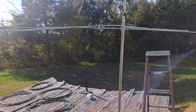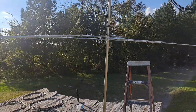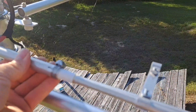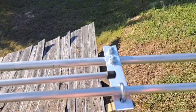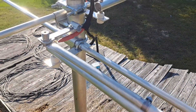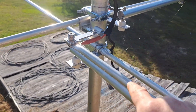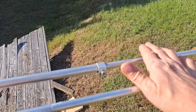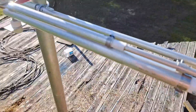To drive a Mako Shooting Star, usually it comes with some relatively small gamma matches. Let me give you an idea of what I'm talking about. These are the little stockers it comes with — you can see the difference in size. It has an SO-239 connector for your regular CB radio connections, and this larger one runs down the element a bit longer so you get more surface area for your beam to receive a capacitance-driven situation.